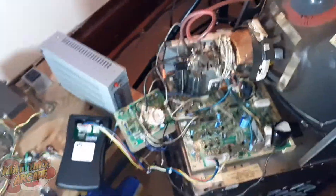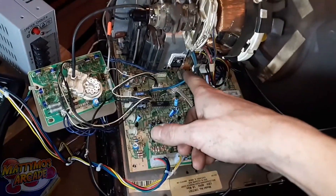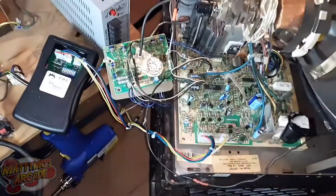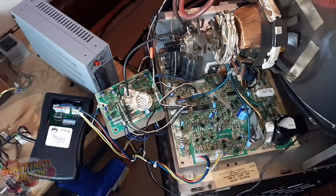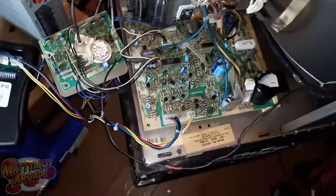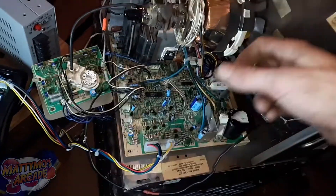I'm scratching my head. I've pulled the chassis out and gone over it looking for cold solder joints, checked the yoke wires, checked header pins all the way around, checked all the pots. I probably took this chassis in and out at least 10 times between yesterday and today, worked on it overnight. The next things on my list would be IC1, that transistor, or maybe a short in the tube or a bad tube.